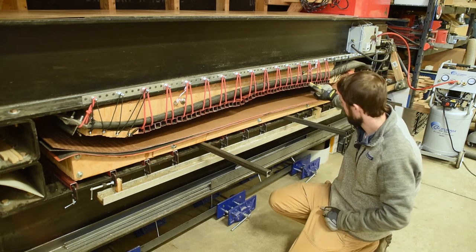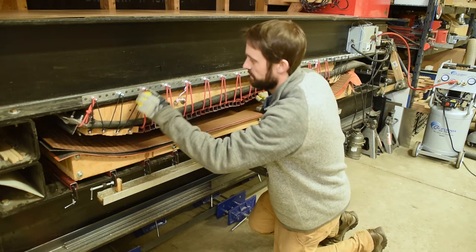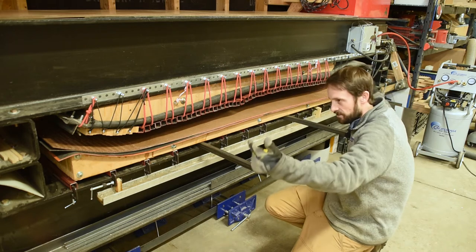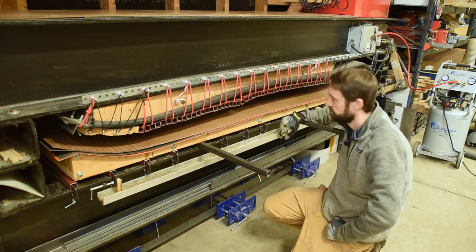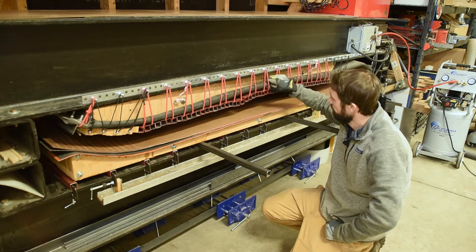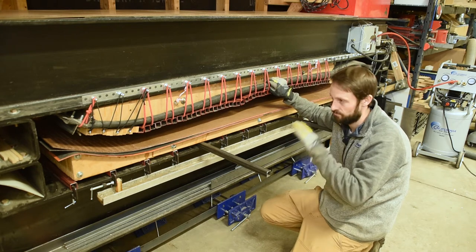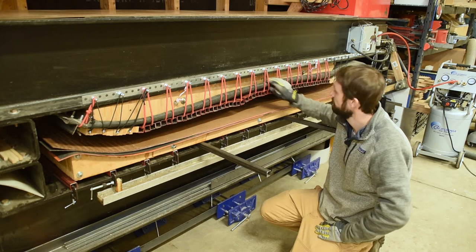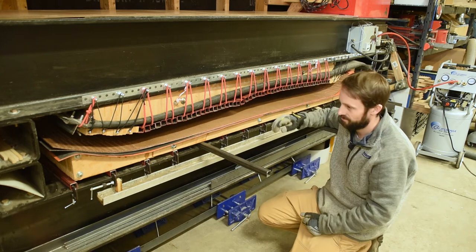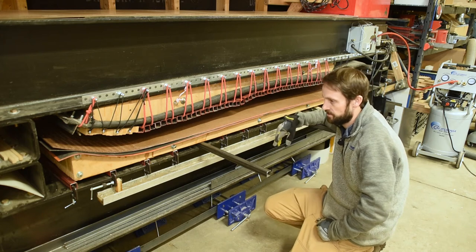This is what I call the cat tracks — just a bunch of steel beams. I use slightly skinnier wooden beams at the tip and the tail to allow a little more curvature there. They're connected with a steel cable running lengthwise and suspended off a bungee cord. This is a lay-flat fire hose, controlled off pneumatic controls which I'll show you more about later. And then the upper mold, which is just the reverse of the lower mold, is a little skinnier to leave room for the thickness of the cat tracks and the blanket up in the tip and the tail.